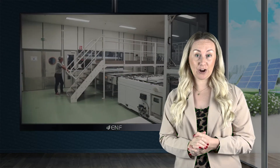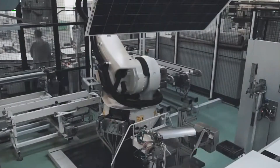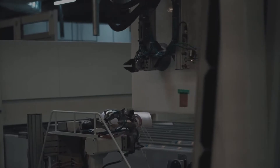This ensures greater performance during extremely hot environmental conditions. The PERC design involves an extra layer added to the cell's rear surface that reflects the unabsorbed sunlight back to the surface for more power generation, leading to an increased power output of up to 660 watts for the best performing solar module in the series, as well as lowering the levelised cost of electricity.